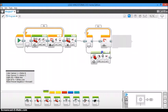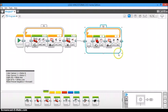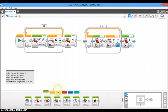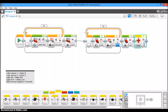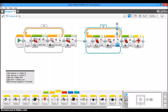Take a large motor block and set it for motor B — we're going to center motor B first. Set it to negative 20% power because we're going forward until it sees the white line — just turn it on. Set the loop to color sensor, reflected light intensity, greater than or equal to 85%, because 87% was what we measured the white line to be. After that, put another large motor block set to off. Then drag out a motor rotation block, set it for motor B, and hit reset. Remember: color sensor 1 controls motor B.